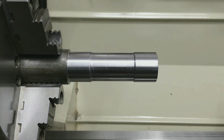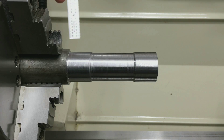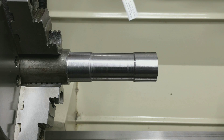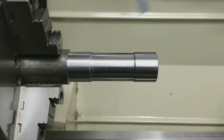You can make it out of any piece of scrap material. The larger in diameter the better — it's going to be more rigid. I started out by putting this in and making skim cuts until I got a good cut all the way across and all the way around the bar. Then I came in with a micrometer and measured from one end to the other, and that's how I discovered I had my three-thou taper.